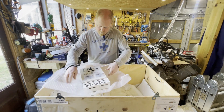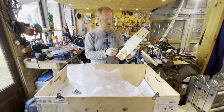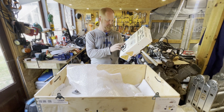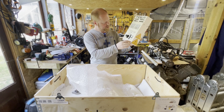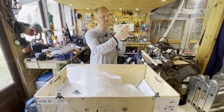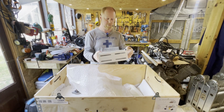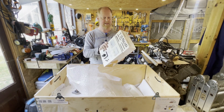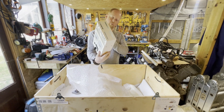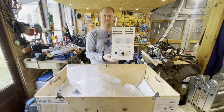Looks like we have a dump load in the top, ammeter and voltmeter, battery on/off switch, inverter switch, battery switch, and a charging current adjust. The holes line up, and some of the ones I've seen previously online had external terminals for some reason — looks like they've improved that. All in all it's been well packaged, doesn't look like there's any damage to it. We'll have to wall mount it off the wall to make sure there's plenty of space at the back for the heat to rise. So, one charge controller.